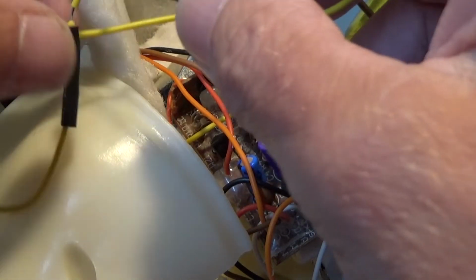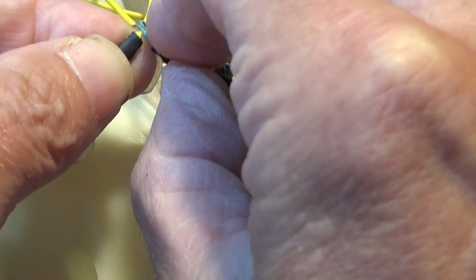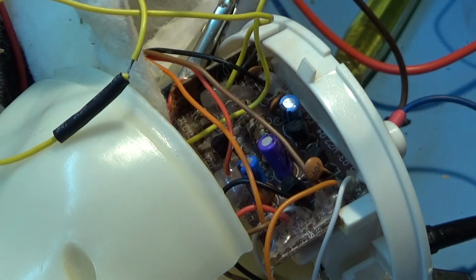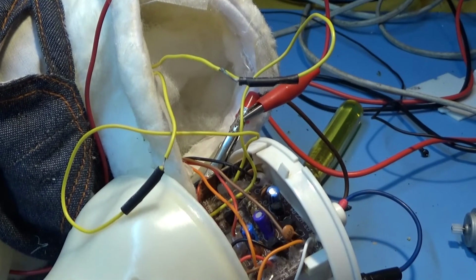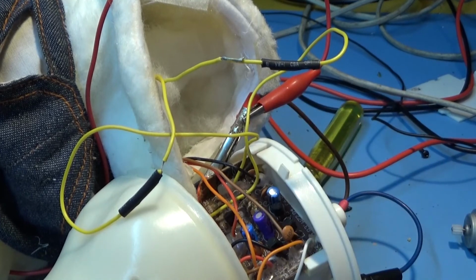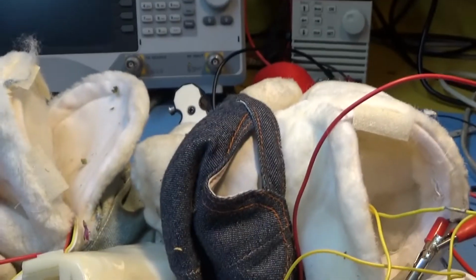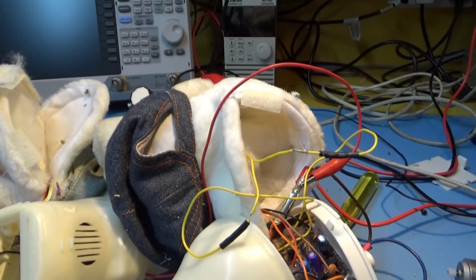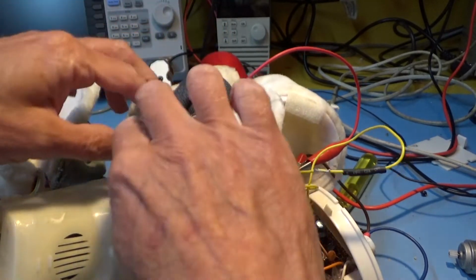And I was trying these yellow wires with the switch on. I wanted to see how they worked, but if you just short them together, oh, it does work. That's interesting. Oh yeah, they do work then, because earlier they weren't, but they are really green and corroded. So it appears to be a normal momentary on switch in his foot over there. Very ingenious, and there's a label on it somewhere. Where's the label? Here it is.